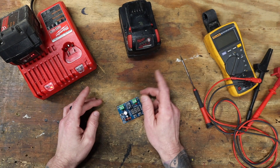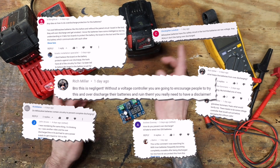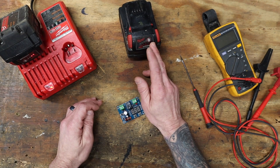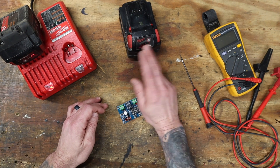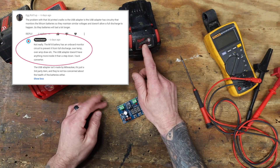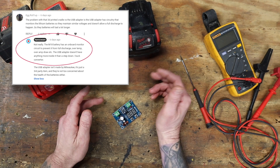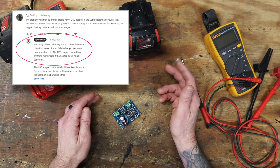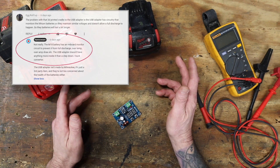But an even more important question was: how do you prevent battery over-discharge? Lithium-ion batteries are a sensitive beast and they can be permanently damaged when discharged below a certain level. I'm going to fall on my sword here — I was wrong about how Milwaukee batteries handled this. It was my assumption that the onboard circuitry inside the battery prevented over-discharge, when in fact the circuitry in the battery is essentially useless without being used in conjunction with a Milwaukee tool. If the tool isn't connected, the battery can be allowed to simply run itself dry.